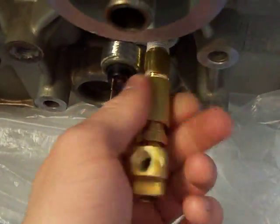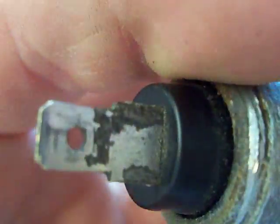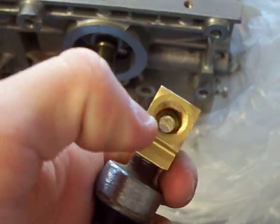28 British will thread right into 27 — no problems at all. Sorry, I kind of boogered the threads on this so it might not work perfectly, but okay — it goes right in, no problems. It tightens up; it's going to be a little wobbly, but once you put Teflon on it, it's not coming out.